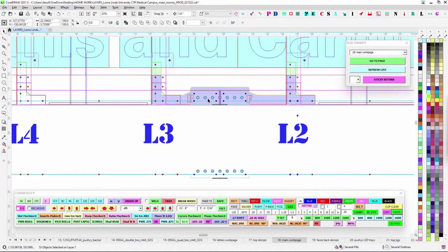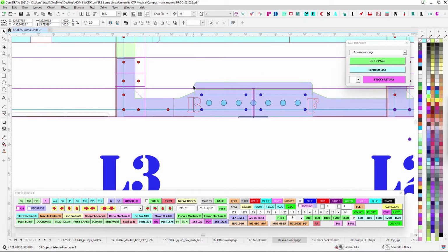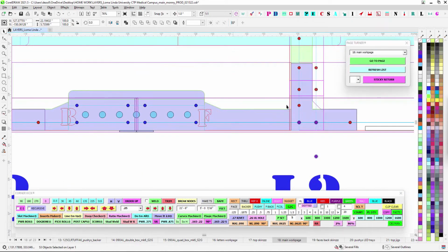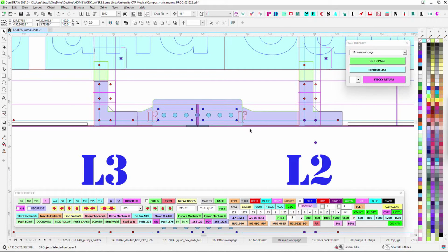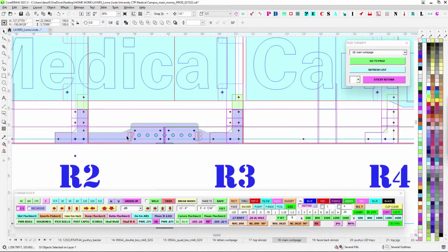You'll be able to plug weld through the jig to nail down this seam, and then weld all along here. You'll be able to weld right in here, and you can even weld on this tab. That's why I poked it up. You could weld the flange to the tab and then grind it smooth for the face when you lord it on. But you have plenty to weld along here. And of course you weld all along here, this is going to really stiffen up this seam. So you'll have that one, and then you'll also have on this side.